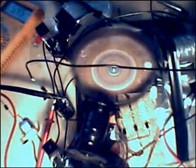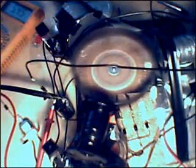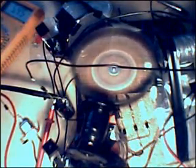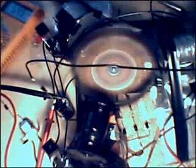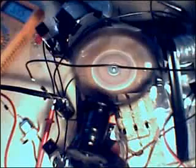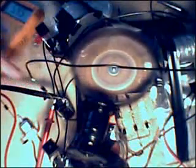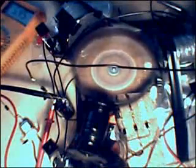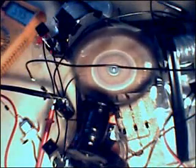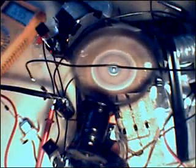First off, I'm having a couple of thoughts which, if anyone's seen my previous videos and can comment on this, it'd be appreciated. I have a diode running off this center cap, which I'm currently probing for voltage, which is 5.45. So they're all 5.45, all the caps, the big 2200 microfarad caps.